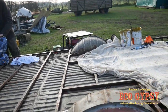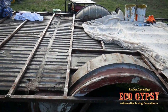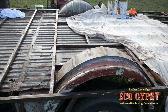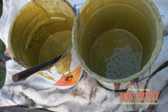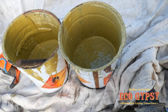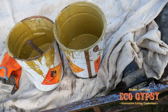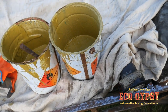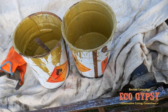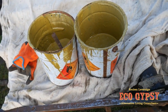So that's all the noisy stuff done - the wheel over this, the grind and flap disc, hoovered - and basically we are now ready for our baby poo pylon primer. This stuff is awesome. This is the last of it, but this is what they paint the electricity pylons with - an undercoat that sticks like shit to a blanket and is absolutely awesome - so we are going to give this a once over with that and we are ready to go for the box.